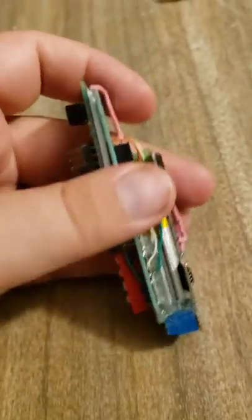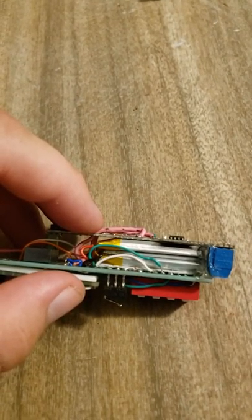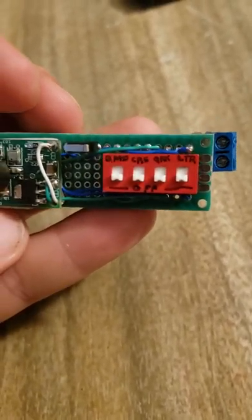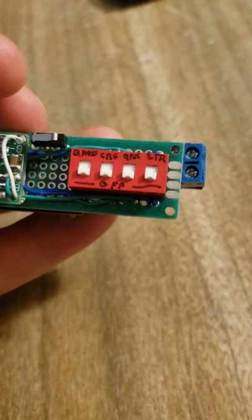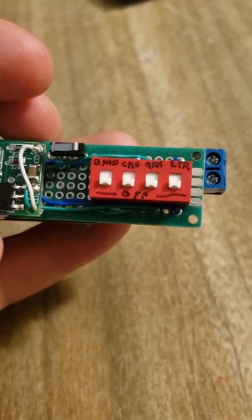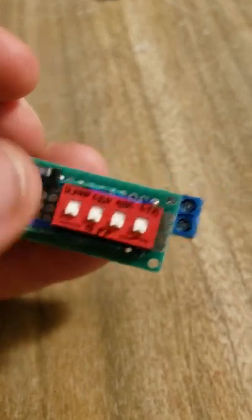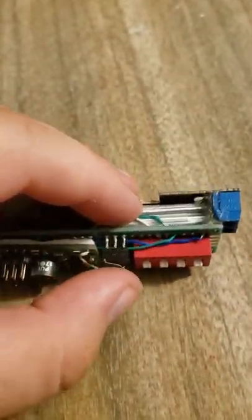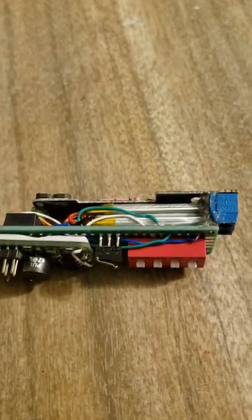Real quick, I'm going to number these. The top one is battery one, bottom is battery two. And then of course, a set of DIP switches — from the right we have lighter power, Quark power, a charging switch, and a bypass. The bypass does the same thing as the little pressure switch here, except I don't have to sit here and hold it. That's for ground testing.